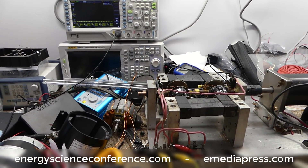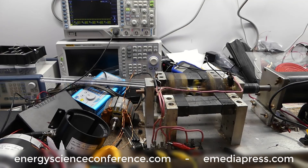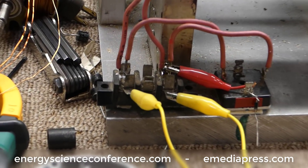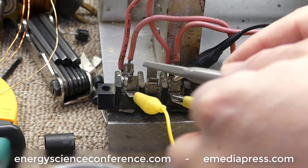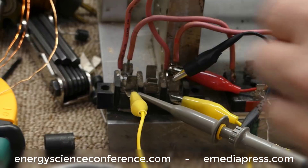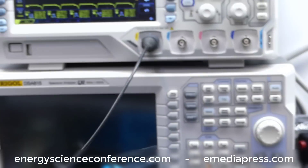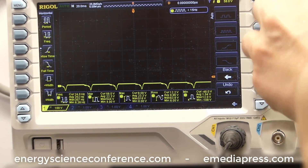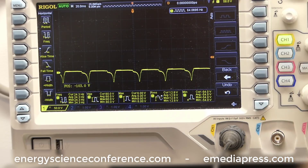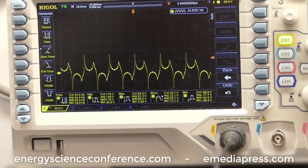Let me get it up to speed — 1,470 RPM. I'm going to put the scope on the AC. There was something shorted on the bridge for a second. Now we've got the classic waveform. The shaft is a little bit off-center with the magnets and the cores, so it's not perfectly symmetrical, but it normally would be fairly symmetrical.